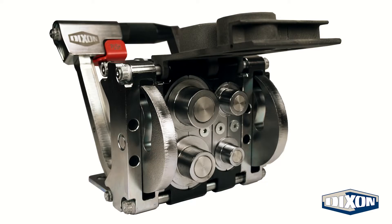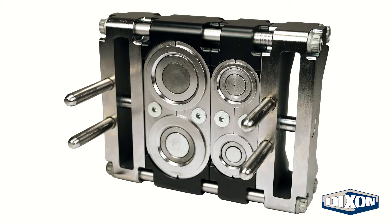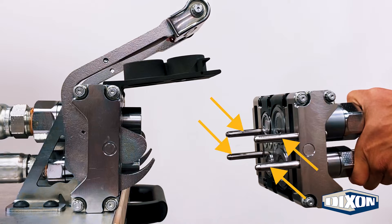The MCS consists of a fixed half with an engagement handle holding the plug-ins, and a mobile half with hose connections configured for the customer's system. The mobile half has alignment pins for ease of connection to the fixed half.